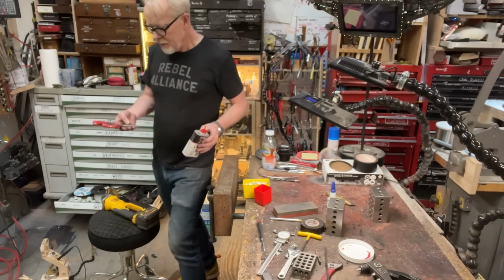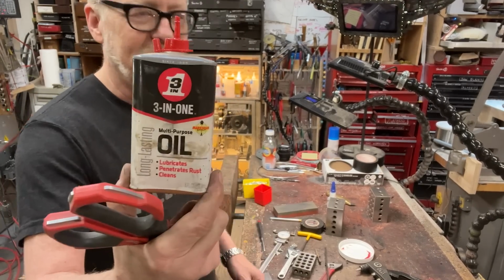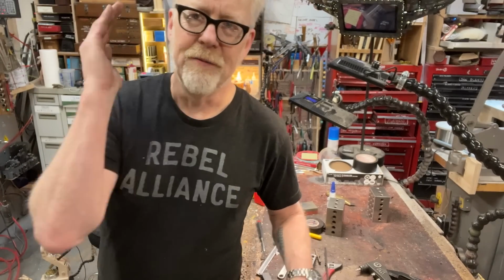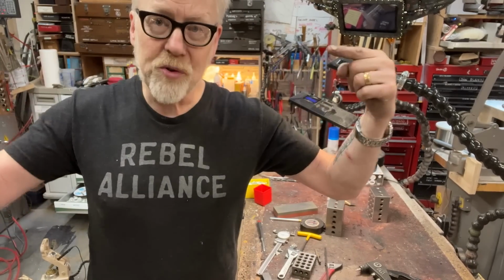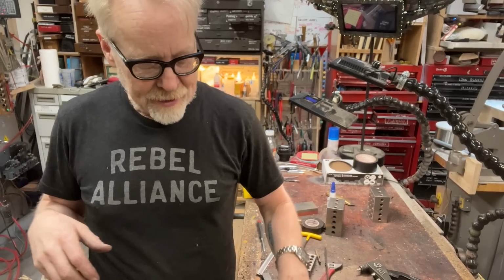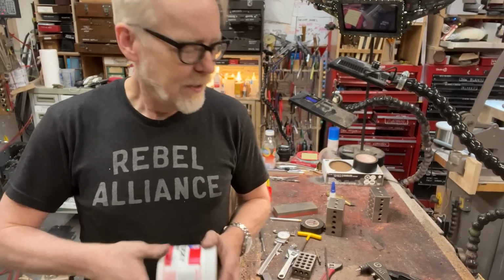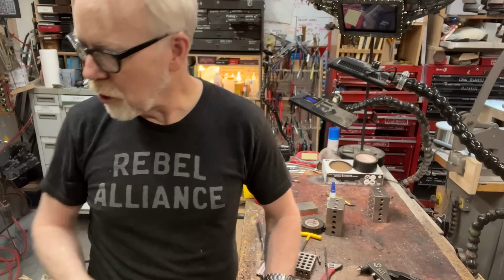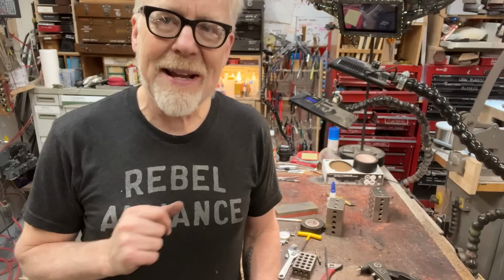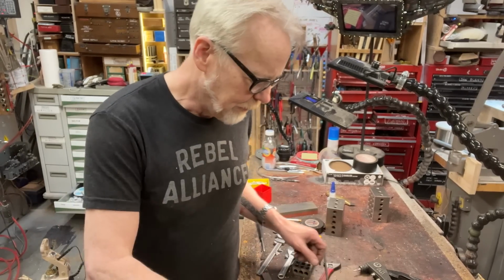Oh yeah, these are the Milwaukee scissors, and I dig them. And yeah, it's really hard to beat 3-in-1 oil as a general purpose shop oil. It's terrific. The main arm of the saw rides on 2 tapered pins, 2 cones effectively. And there's a mechanism for tightening it up. I gave it some of this super red and tacky grease in there. It's just a movement that does this repeatedly for long periods of time. The thing has oilers everywhere for keeping it running smoothly. I may make a couple of oil cups soon as just part of getting some stuff done on it. Red and tacky grease.